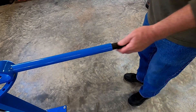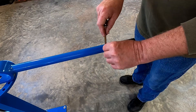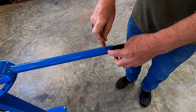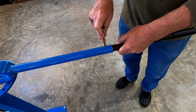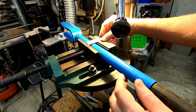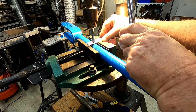The handle did not have any type of pin to keep it from sliding in and out, so I'm going to use one of these hitch pins you get at Tractor Supply. I want to drill a hole about an inch back from where the handle is closed, then pull it about halfway and drill another hole. I'll measure the jaw opening and divide it by two to determine where my center is going to be, then center that up.